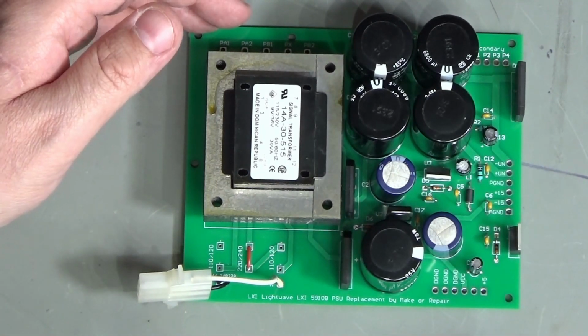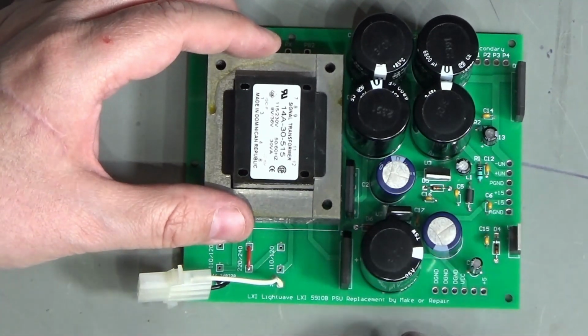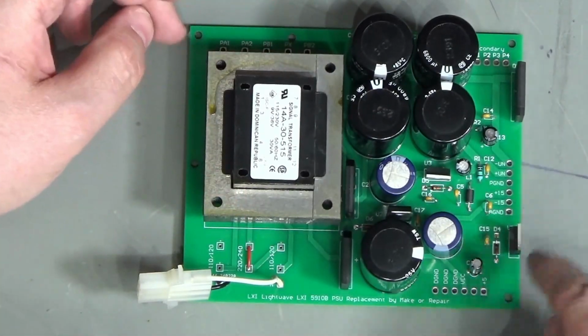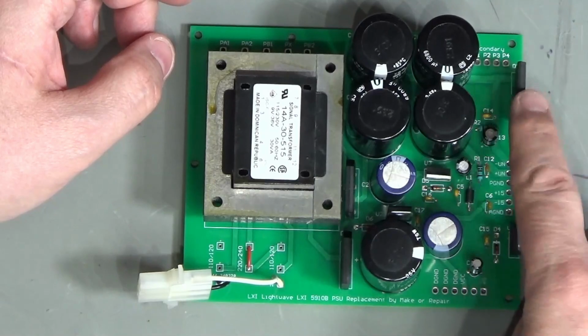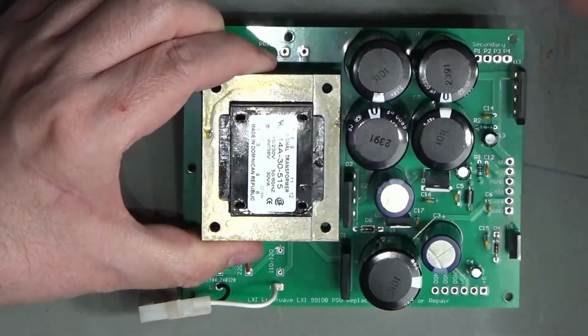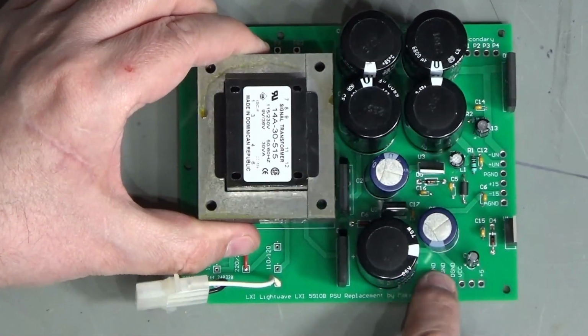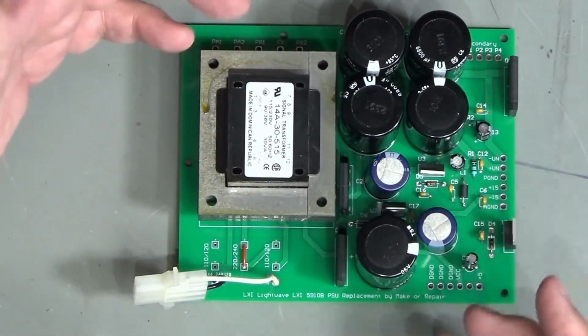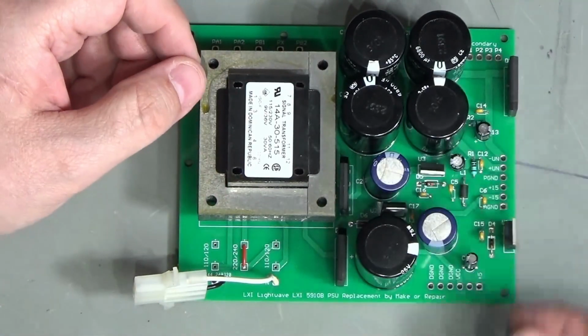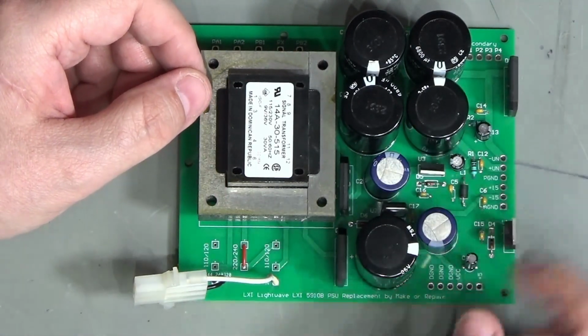Yeah, looks okay, I think. Looks very much like the original. The layout isn't quite the same, but because the holes are in certain positions, these two components had to be in exactly the right position, and I wanted to make sure that all these connectors along these edges were in identical positions. That kind of dictated that the layout I produced was going to be very, very similar to the original one that the manufacturer produced.